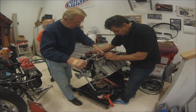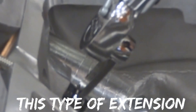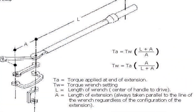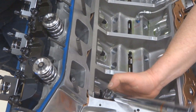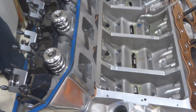The longer the torque wrench, the less effort it takes because you're working on a lever. If you have to add a short extension — say the fastener is in a weird spot — you need to do a calculation to calibrate your torque setting. For example, if you have a 10-inch torque wrench from the center of the handle to the head and you add a 2-inch extension, it must be straight outward; otherwise the geometry changes and you have to account for the actual added length.